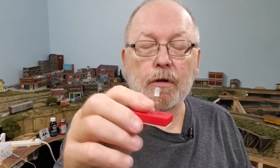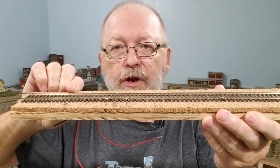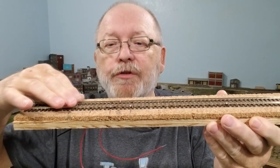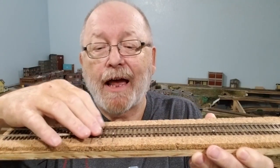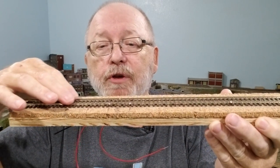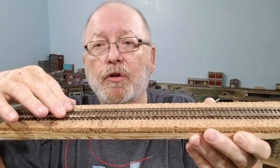We're going to take a 1k ohm resistor and put it on our red green bicolor LED, and I'm going to put it on one of these small breadboards just to signify someplace either in your panel or on your railroad, someplace where you could tell that you have a green or red indication in both areas. Now, the idea of this is if you're coming over here with the locomotive and the LED over here is green, you want this LED right here to be green also. So when the locomotive comes over it, it's not going to stop or short out because you have this one backwards. So now say if this was green here and this was red here, you would want to change this section over so it indicates green so you could proceed through here.